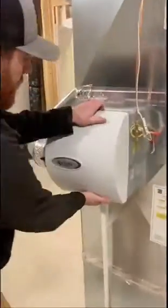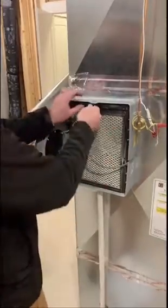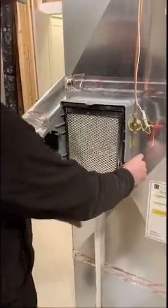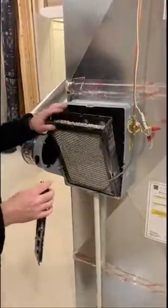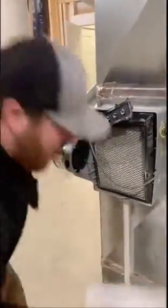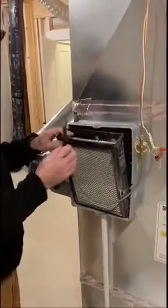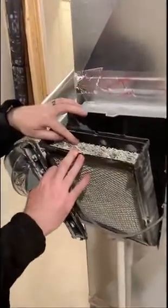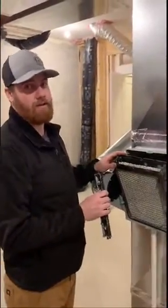Moving over to the filter, you can pop this filter right off there. We've got the filter in here — pull out the water line and get that out of the way. This slides out and the cover pops off. Make sure that you buy Aprilaire brand filters; the version for this would be an Aprilaire 600 series. When you get the new filter, on one end it is going to have a black, blue, or red paint stripe.